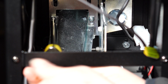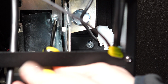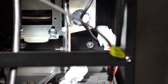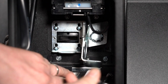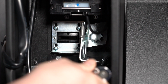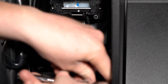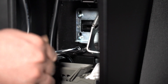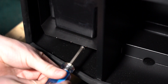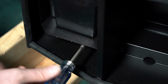Next, remove the screw securing the coin chute. To help gain access to where you will be installing the card reader, use an 11/32" nut driver to remove the nuts underneath where you removed the coin chute. Then use a Phillips screwdriver or a nut runner to remove 2 screws at the bottom of the machine.